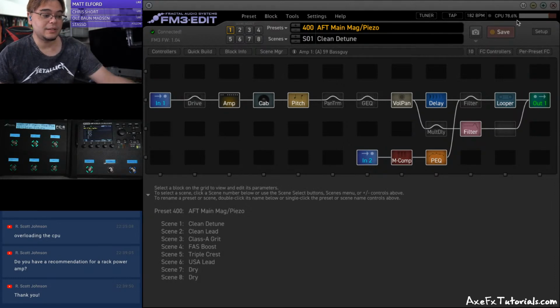And I've heard people have great success using sort of your classic power amp for a PA system, like your QSCs or Crown amps, things like that. Those go straight to the guitar cab, and those work well too. So I think anything can work as long as the power ratings and ohms all work out, of course. But it really just depends on what you want to accomplish.